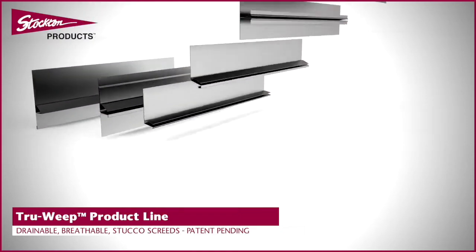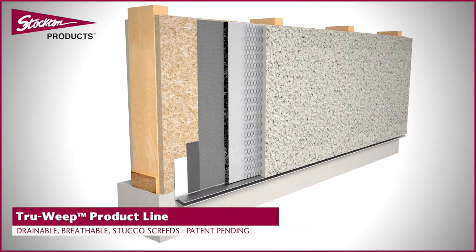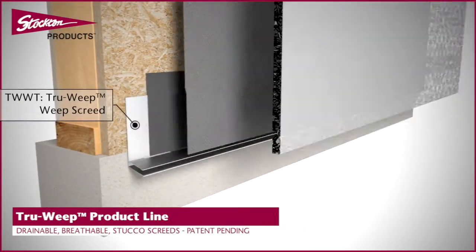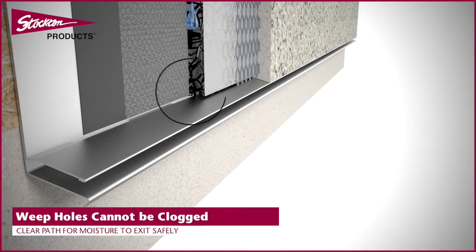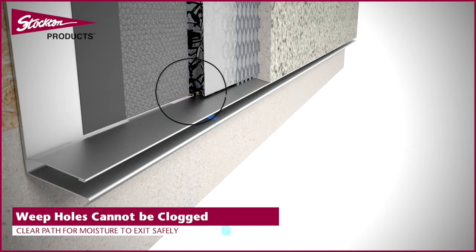Stockton Products introduces Tru-Weep, a complete line of stucco accessories specifically designed for accommodating drainage mats within stucco assemblies. The Tru-Weep product line maximizes the drainage and ventilation by aligning open air slots with the drainage mat. Weep holes cannot be clogged with stucco because the slots are located directly under the drainage mat.